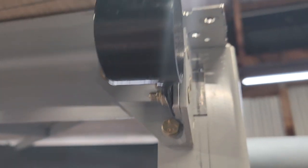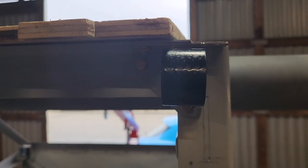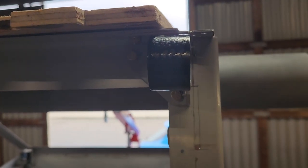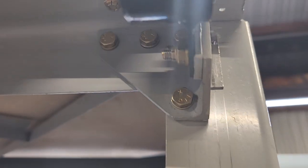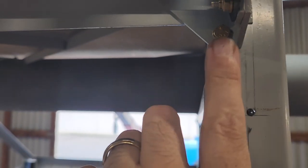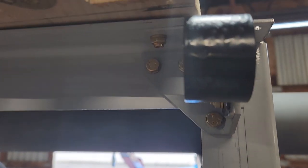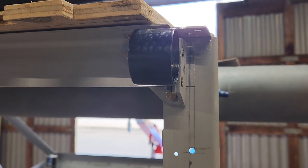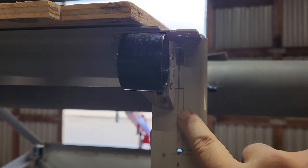The other thing, and it's probably a very good thing, you can't really tell, well, I guess you can tell on the camera, this might be just like a millimeter crooked. So with that spacer, I can just mill it out and bring it to the right angle, even though this might be slightly, you know, a millimeter off. But it actually works out very well to do it that way. I'm gonna take this off because it just gets in the way of trying to do this.